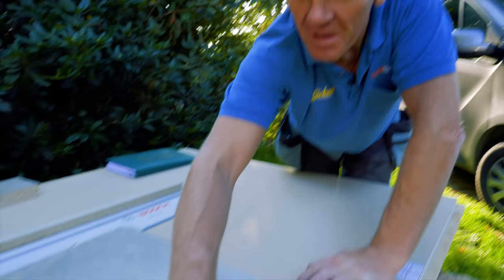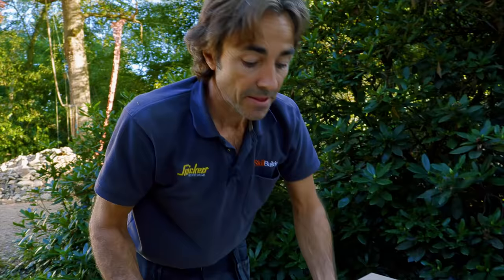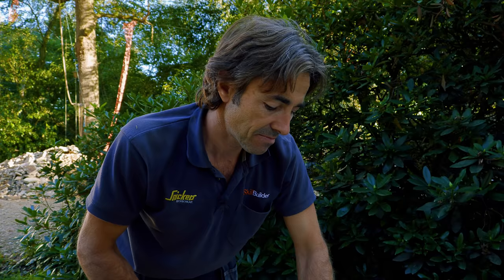That's set dead on 40. My first impressions are that it handled it perfectly — there wasn't a lot of resistance and the motor wasn't really struggling at all. I think it's a robust bit of kit. The blade — it's got a lot of teeth, almost negative rake, sort of like an aluminium blade. All of these things have a lot to do with the blade, no doubt about that. When you look at it, people say it's very similar to the Mafell — in many respects it hasn't got quite the refinements, no micro-adjustment for depth and so on.